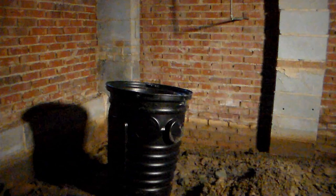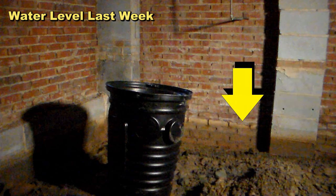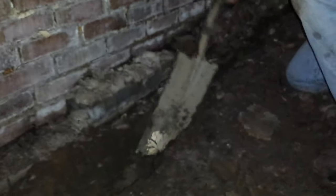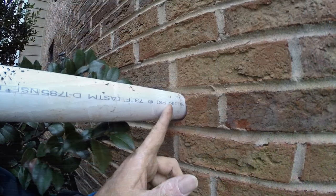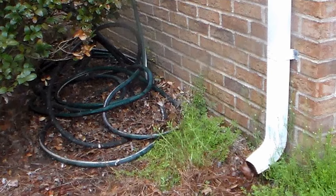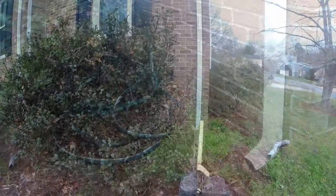When I came out here to give this estimate for the flooded crawl space, the water level was this high. I had to put on my boots and wade back in here just to look at this crawl space. So many homes are built without drainage. We can install a sump pump, dig the footer tiles, core the wall, and bring the water outside. But where will it go when it gets outside? So to solve this problem, not only do we have to work in the crawl space, but we need to install a new downspout drain.